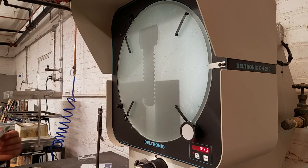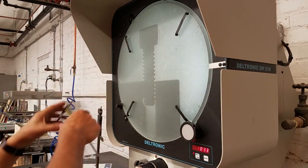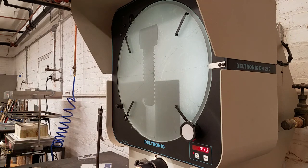So that's pretty good. We could also, if we didn't know what the thread pitch was and didn't have a thread gauge, measure any other feature that way. And if you wanted to measure a different profile, you could just change the orientation of the bolt in the little vise.